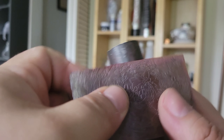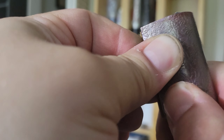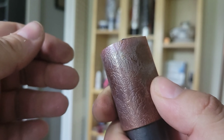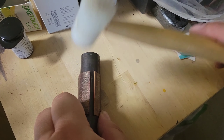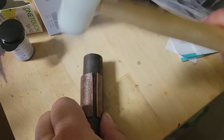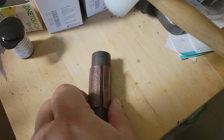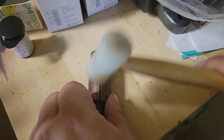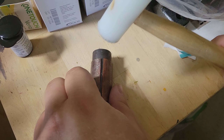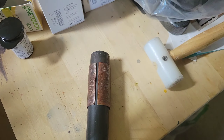Next we have our shaft and it's just me brute-strength bending it. You'll notice it's darker because we've annealed it again — I mean, I'm strong, but I'm not that strong. Our goal, if we've done it right, is to get this seam as close together as possible for the silver solder — it doesn't fill gaps. We're using a nylon hammer so it won't stretch it, but we did end up using a metal hammer just to get it that last little bit. What I would do is take it off the shaft and then slightly overbend it with my hands, and we'll see it comes up to a pretty good tolerance.